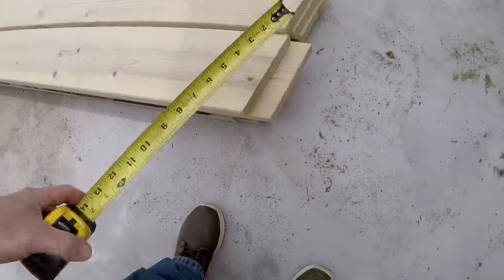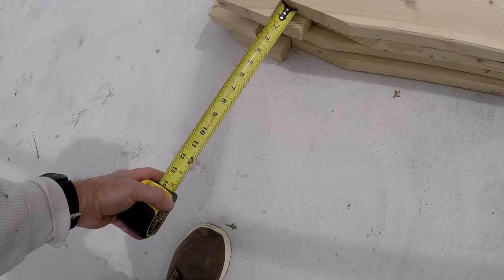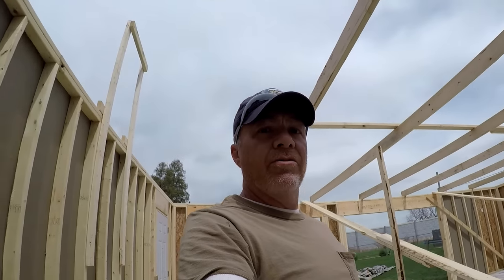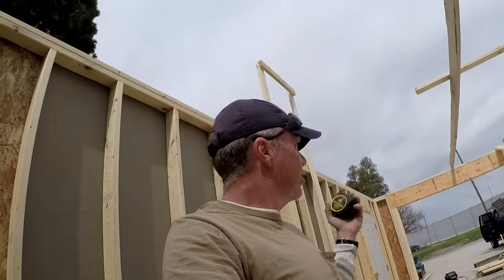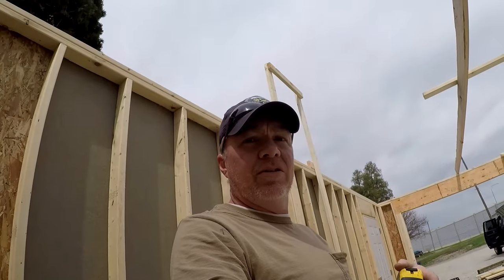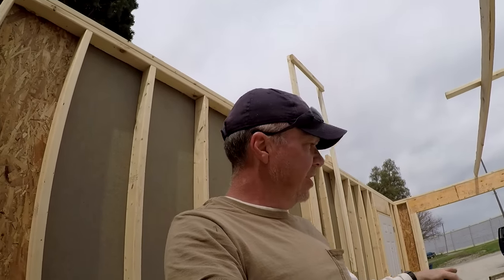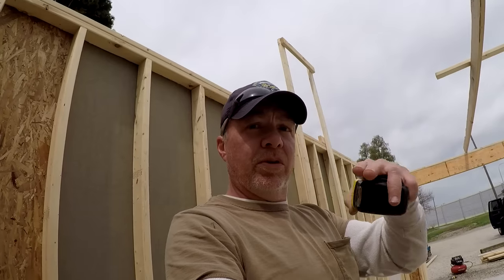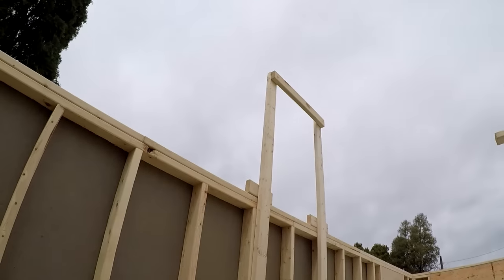It's like 1.5 inches there that it comes down below the rafter, and then the rafter is sunk down another 1 3/4 inches. So rule of thumb for me is you would take the pitch, the run, so 12-foot run, 4-inch pitch, 48 inches of rise, then just subtract the 4 inches because the ridge is below the rafter, and then the rafter sits lower because of the bird's mouth. That's how I figure out where to put those.